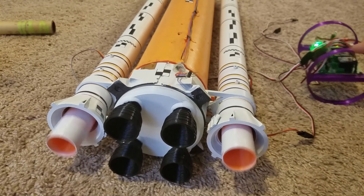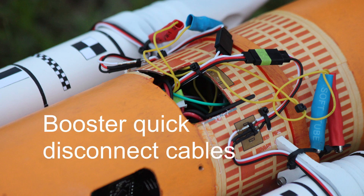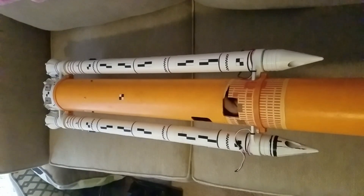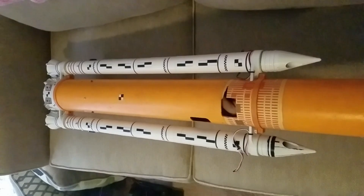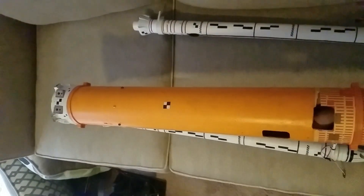The thrust vector system seemed to work pretty well, so I was pretty confident in that. There was a decent amount of wiring checks on everything, so everything was for sure wired up correctly. The main issue during my first flight was boosters not disconnecting, so the Block 2 was intended to alleviate this with the new better booster that had better mounts and would disconnect a lot better.